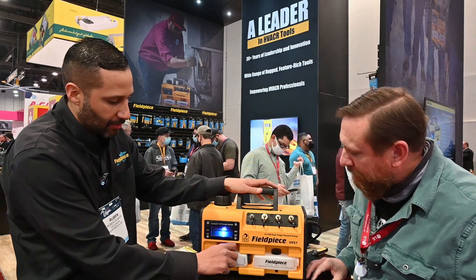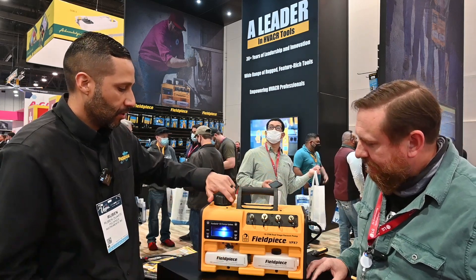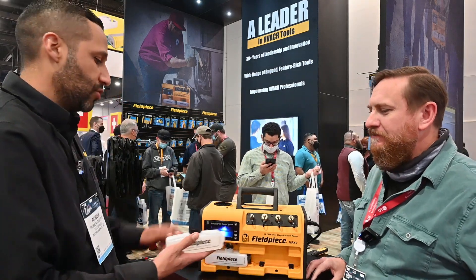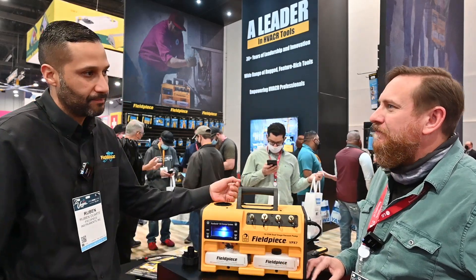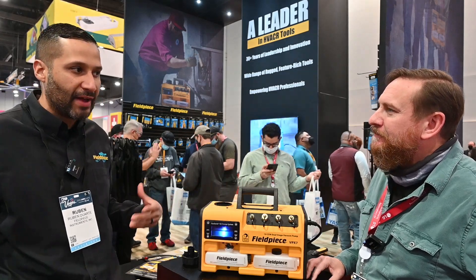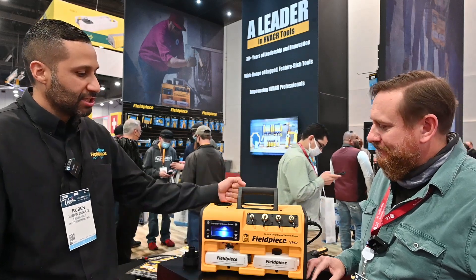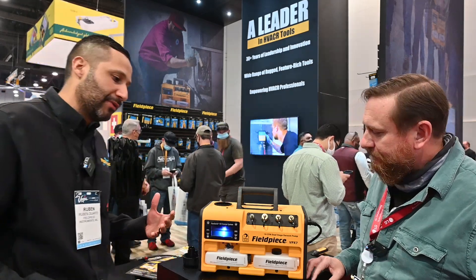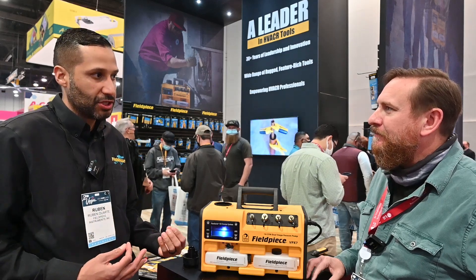So once the oil is dirty, you can open this knob. Dirty oil falls into the reservoir container. We have a funnel that's built into the top — you get the brand new oil and pour it in. You never turn the machine off; you do this while the machine's running. This oil reservoir can be empty for almost two minutes before your vacuum will start to leak, and you can do the oil change in about 20 seconds. So technicians don't have to stop their vacuum to change the oil. It's very fast, very clean, very easy. It really incentivizes them to change their oil and therefore have a faster, more efficient vacuum.